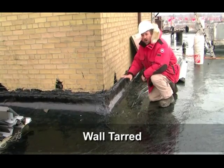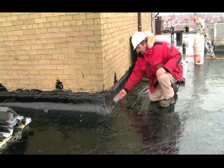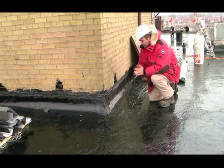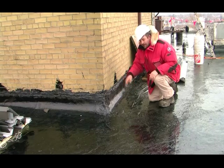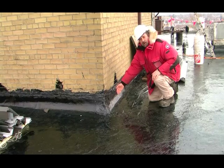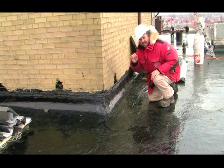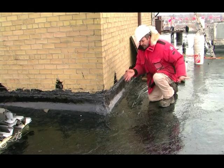Here I'm showing you a typical wall flashing detail — we're taking the roof system up the wall. The reason we take it so far up is that if you ever get a sewer backup where water cannot go down the drains, you want your up-walls and all details very high. If the water level rises and you have a low detail, water can fall in behind it, but a high detail far up the wall prevents that.